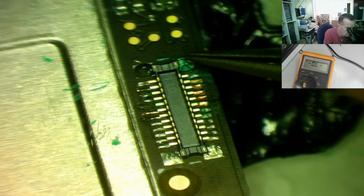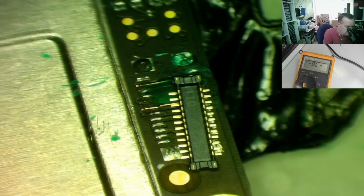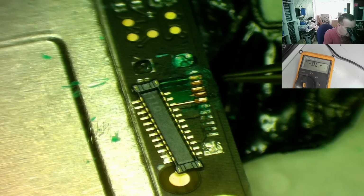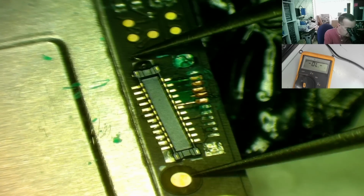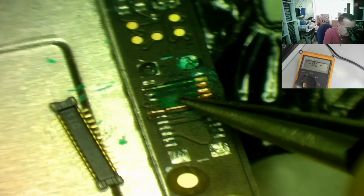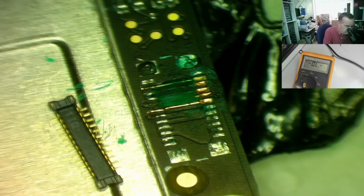I can fix that one, but I just want to see if this thing will actually fit the connector. Oh, I'll just try one of the wrong type. Okay, so it does fit in place, but the solder mask there is sticking up too much to get it to sit flat. This stuff seems to come off fairly easily, at least with a bit of ISO. So I think probably I would just clean that off now with a bit of ISO.